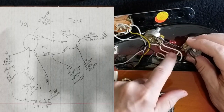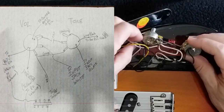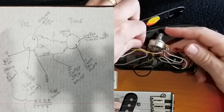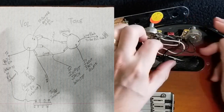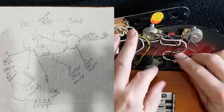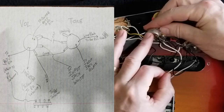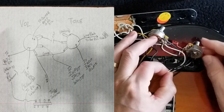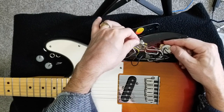And then you have this wire that connects the two together, and that same wire goes over to the three-position switch. There are only two wires left and they are both from the input jack — one of them goes to the volume center, that's a white wire, and the black wire from the input jack goes to the casing. Now it's time to take it all apart.